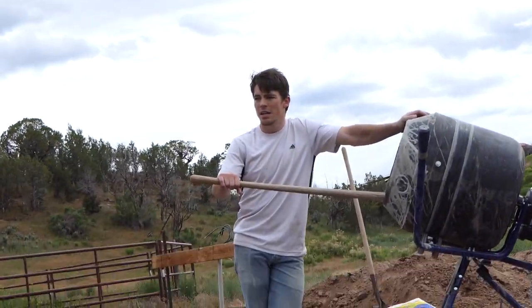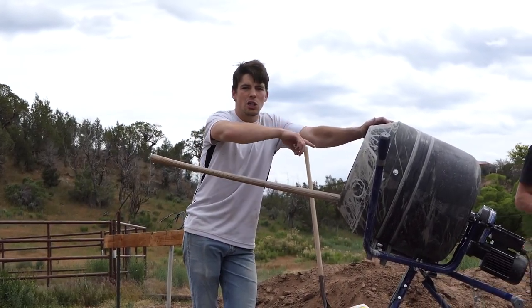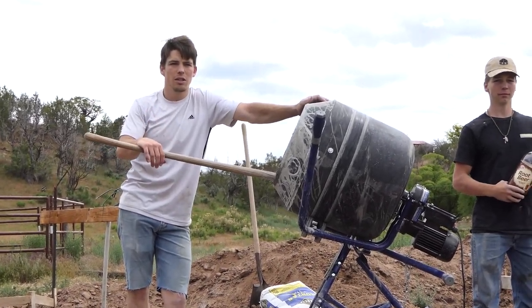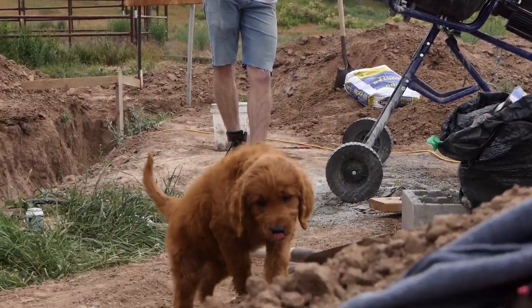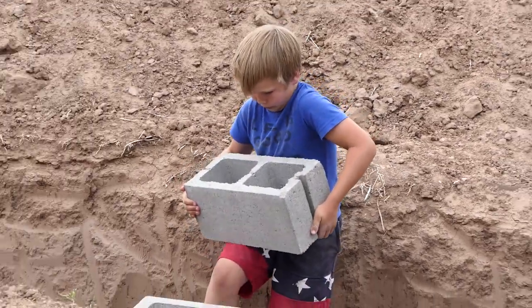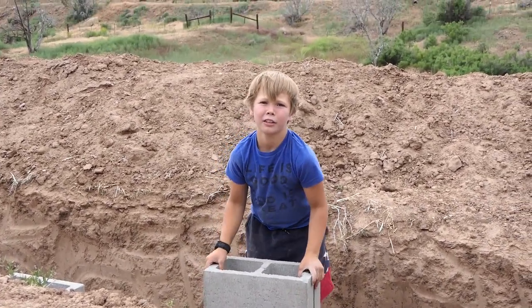You fix it with mortar. Then we take all Dad's issue out because he did it wrong. That's why we have that pink line. Yeah, that's what the pink line is. That pink line is a completely perfectly level rectangle, if I just made this as uneven as possible. As long as we're close to the pink line. Over here is kind of high. That's why we put these story poles. Nice.